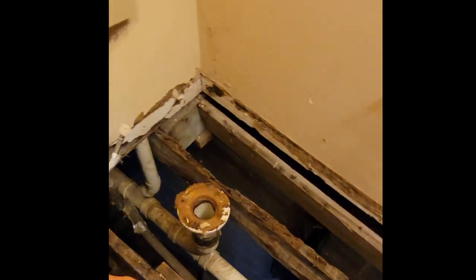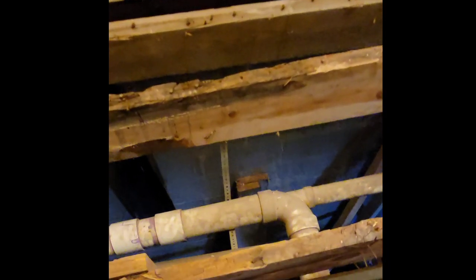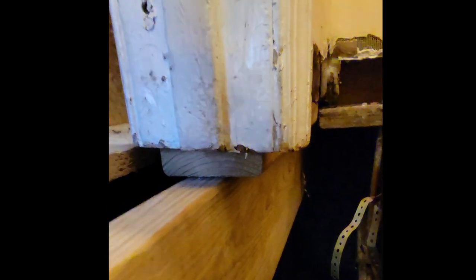Here's the bathroom floor. I tore it all out and down there I had to build scaffolding so that I could feel safe. I had to light it all up, so that took a while. There was absolutely no joist underneath this wall right here. Even though it's not that much of a load-bearing wall, it is still up there and it still has a floor system on it, so it is carrying some weight. The plywood down here is completely disintegrated — it's just a plate on top of the joist. That actual bottom plate was disintegrated down to only about a half inch thick. I've replaced that — don't ask me how, that's a Spider-Man move right there — and I even notched in for the electrical. Boom.